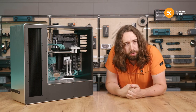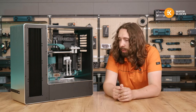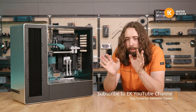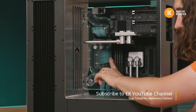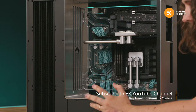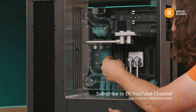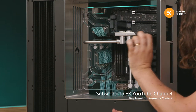Horst, how did you splice parts of the cable? Just soldering and heat shrink? Yeah, so basically, it was really complex. I cut 24 wires that were all long enough to get from here to the furthest point on the power supply. So they were all long enough. And then I put them in one by one on this end. So pin 1, pin 2, pin 3. And threaded them through to the plate in the case,